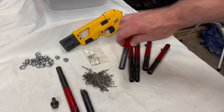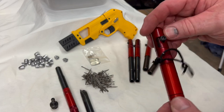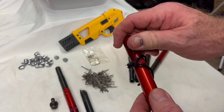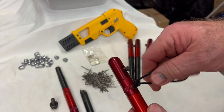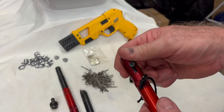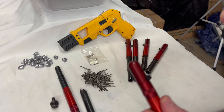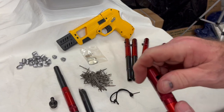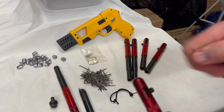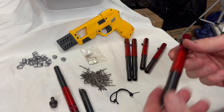This is probably the first pin gun that I know of anyway that has a built-in safety. There is a safe point — the hammer is actually touching it right now even though it's in the safe spot. It's resting on this, which provides even more friction from that thing coming out. When it comes over it's in the path of it — it cannot go down with that safety in place. Once I pull the safety out, the hammer is able to move. You'd have the hammer over on this side; once the safety is removed it can fire.